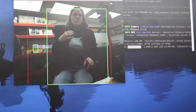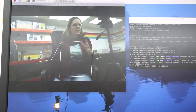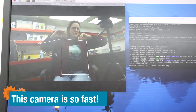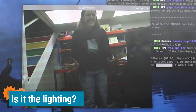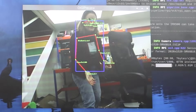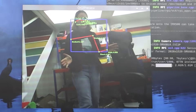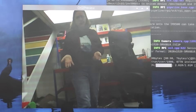Number one is object detection — it's detected me as a person, around 73 to 80% sure I'm a person, and it's detected a bottle behind me. Then we have pose detection using the PoseNet library, detecting elbows, shoulders, and hips, which is pretty good. And there's pose detection using the Pi Camera 2 library, which I really liked for the detail it showed. I'm going to play around with the code and find the best one for just getting coordinates — I don't actually need face detection specifically, just body, so the first object-detection one identifying a person would work.